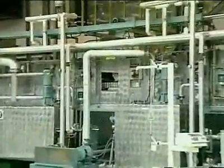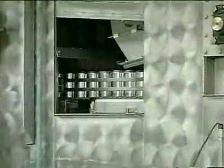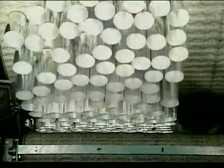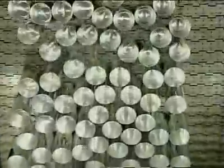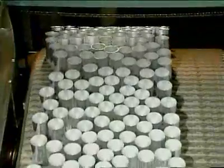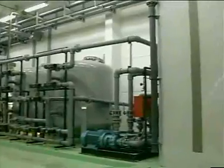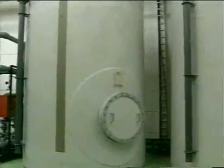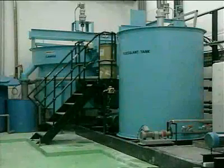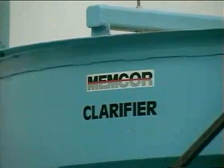Before being dried, a mobility enhancer is sprayed onto the can, reducing the surface friction of the cans to improve both the drying process and downstream can handling. The water needed for washing the cans is taken from the local water supply and treated to meet the high standards required by the washer process. Wastewater from the washer must then be processed through a water treatment plant, ensuring that discharged water conforms with local regulations. This completes the front end of the two-piece can making process.